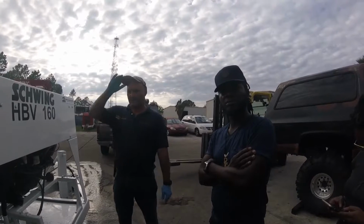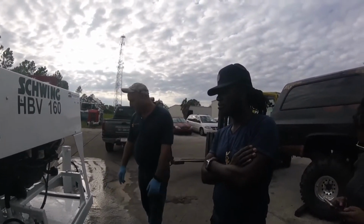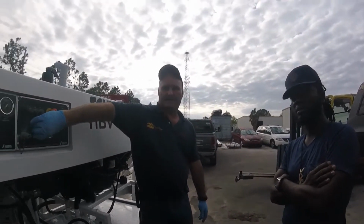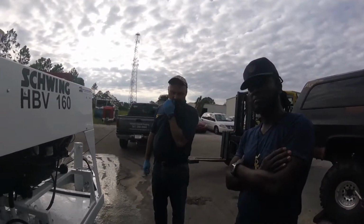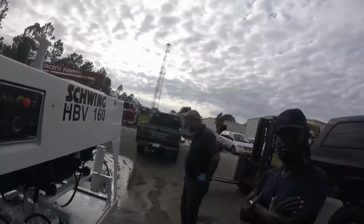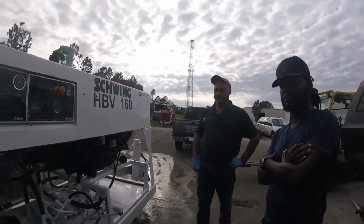So if you're pumping, and you're like, hey man, this was pumping perfectly, and it's no longer doing it, what's going on? Well, first thing you do is make sure your fuel relay, you can hear it. And if you don't, and all my e-stops are out, then you start checking each one of the e-stops to see which one it is. And once you assess, okay, the one that is bad is this one, just take it apart, take those 2 cables and put them together. Yes, and that would allow you to pump.